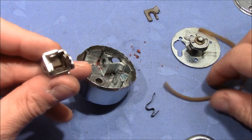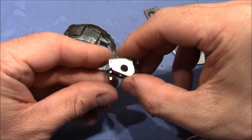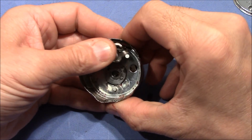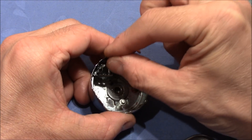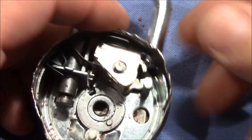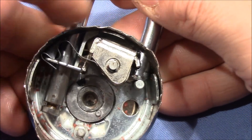So I used an elastic band and cut three pieces off and put them in this gap here. Now I can add this piece to the whole block and put it back together. The spring was missing. Now the shackle — I think it works. You can see now the locking piece here sticks out. And when I now push in the shackle, the whole block turns and it's locked up.